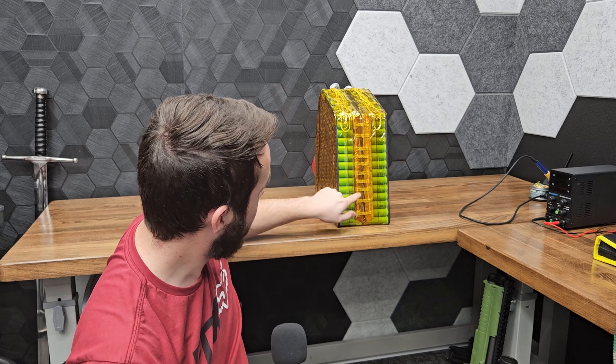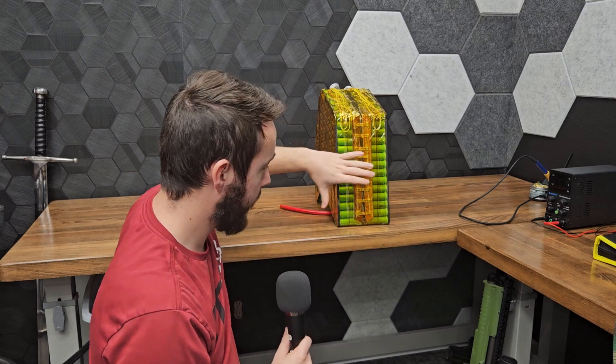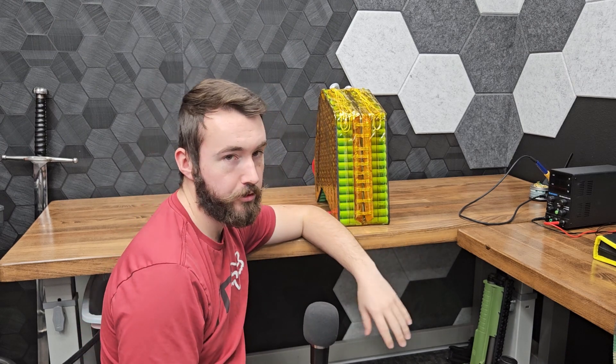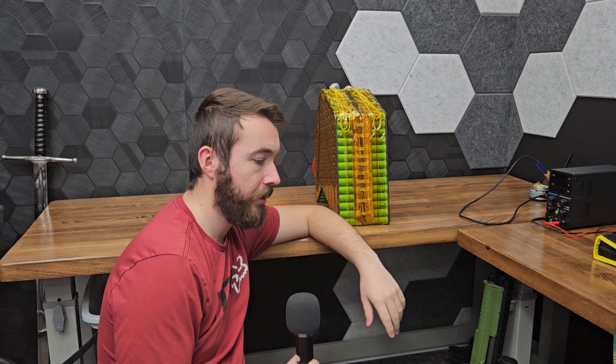So I came up with this: two separate copper sheets with copper braid soldered between them. There was a lot of good and bad that I learned from doing this. I think this is something we can keep doing with a lot of success, but there are some key points to get across. First, I made sure to make my copper braid sections just a little bit longer than needed so that when I push the battery together it compresses them slightly rather than pulling on them. If it pulled on them it would do a lot of damage to the connections. When you first solder them this short, it's not super easy to bend right away because it's all tin with copper — that's okay, you just need to work it a little bit and then you can move it just fine.